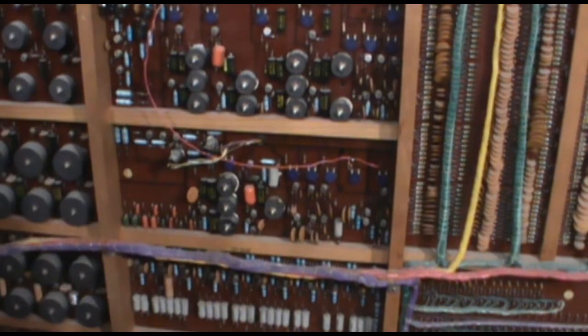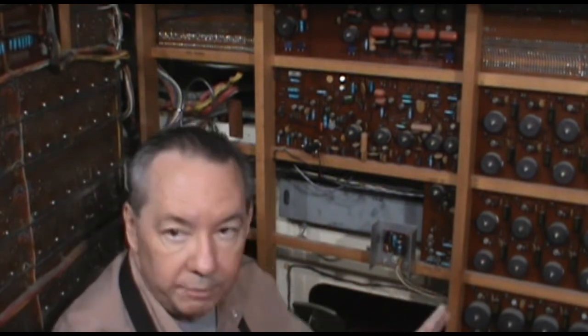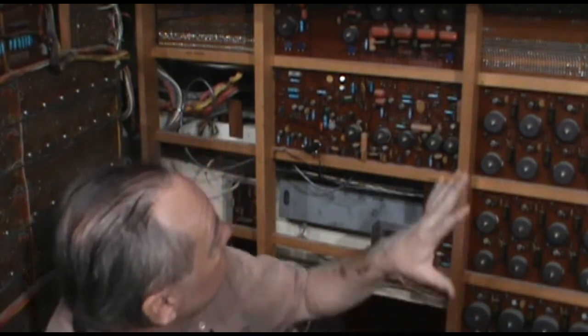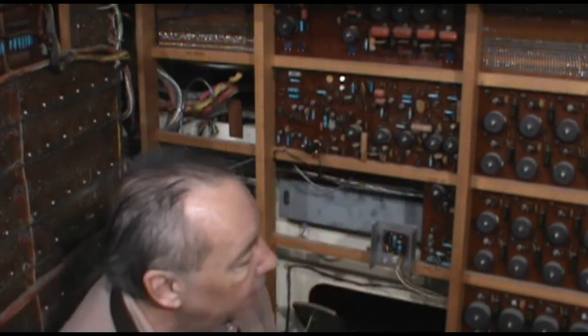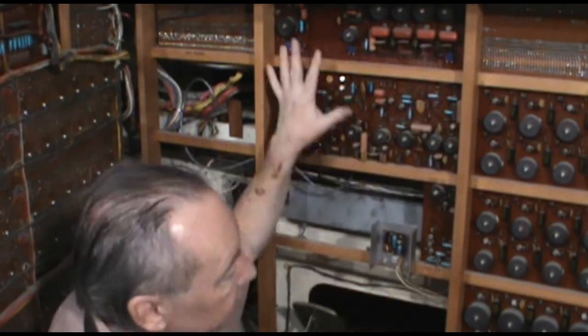Now, let's take a look at today's project. Today's project deals with rerouting the trap and the piano circuit. The percussion instruments on the 33E are generated in a couple of different ways. The traps, snare drum, bass drum, cymbal, tambourine, that kind of thing, are generated by independent tone generator and filter circuits. They have their own oscillators and everything, and those are right in here. This is actually the celeste oscillators. So we have all of our trap circuits.